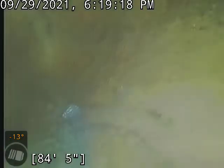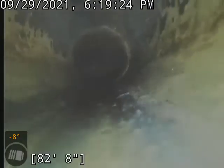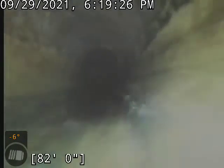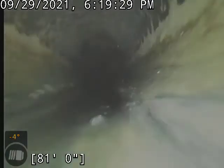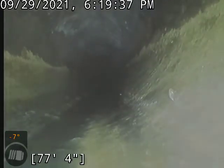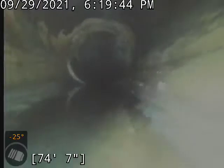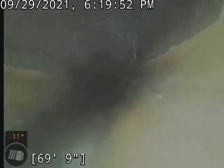With clay lines it's typical to see roots and offsets — here's one right there, not bad, nothing really blocking flow. You can see a little root crawler right there, nothing bad. We did just run a green cable, just a 50-footer, to clean up the cast iron. We did some d-scale so we didn't really run any machine down this far. This clay line looks pretty good — again, roots and offsets, you always see that.